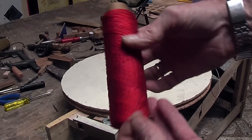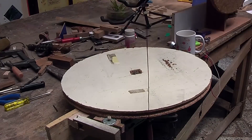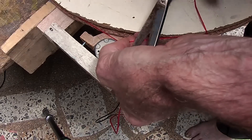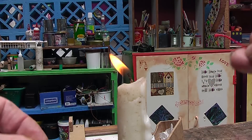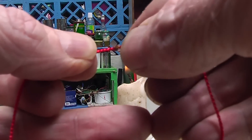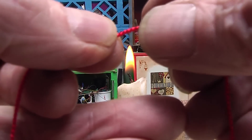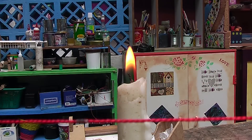There are a couple of things to do before we put it on the wall, and one is getting some thread to make a belt. Now this is a synthetic thread, so I am going to be able to put it right round. I am going to wrap it round, just measure it and snip it off. Because the thread I am using is synthetic, I can just carefully melt it in a flame and then stick them together. As they cool, I can roll them in my fingers — make sure you don't burn yourself because it does get hot. And there we have a joint that is strong enough to do this job.